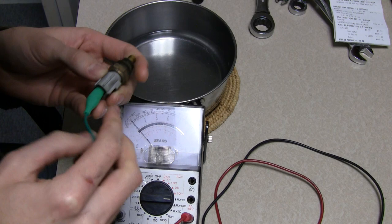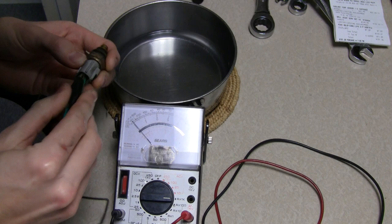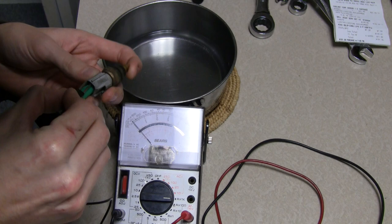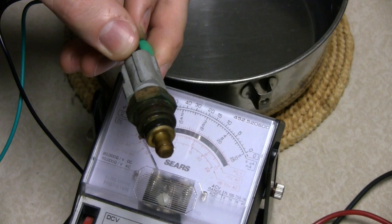Now I'm testing the old sensor, and I can tell there's a problem already because I'm not getting any resistance reading at all — the needle isn't moving. It should come up to about the middle with it just hooked up. I'm not getting anything, so there might actually be a total open circuit inside. I stuck it in the boiling water and it's not moving at all, so whatever happened inside — probably from cycling over the years — some connection was broken.